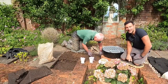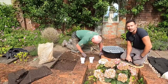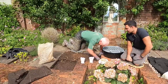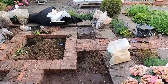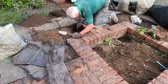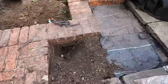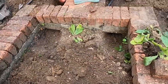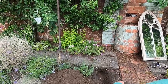If you've been following any of our other videos, you'll know that we have just completed a very large pond installation — a lovely formal square pond — which was quite a large job and took a lot of weeks of hard work. So doing something smaller like this is a bit of a luxury for today. All the cobbles have been lifted from the outer quadrants and Dave's been doing a great job of tunnelling between each section. Each individual light sitting in each one of these corners is going to have its flex channelled through into this central section where the water feature is going to go, and then all of the cables are going to run off to where the power supply will be fitted up onto the wall over there.